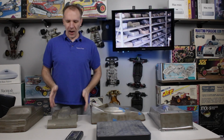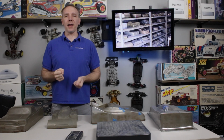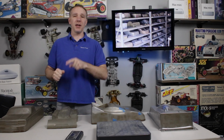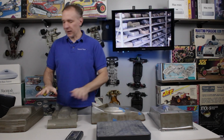And then when you were all done with that, you would put it in a box and pour some sort of form material in there, silicone or something else, to get a female version of that basic master made. And then once you did that, you pulled out your master wood or plaster form that you had carved. And when you did this, also I should mention, step back, you would just get the basic form of the vehicle.